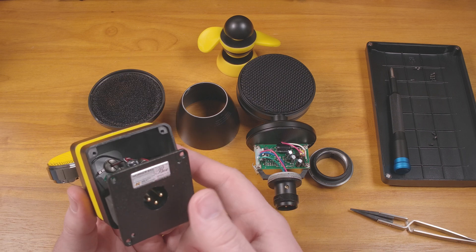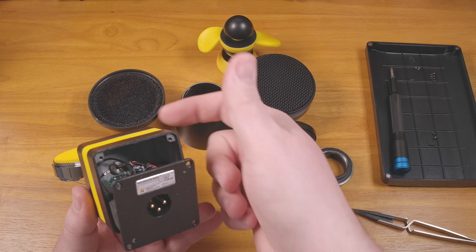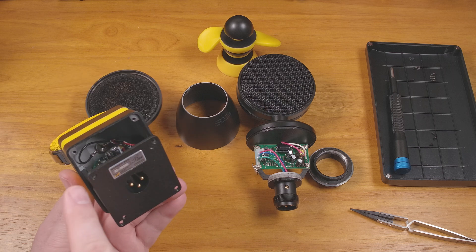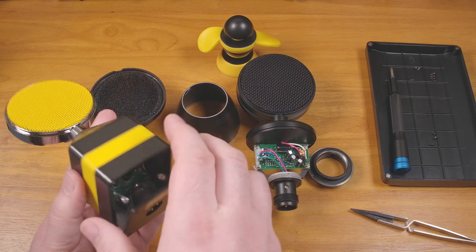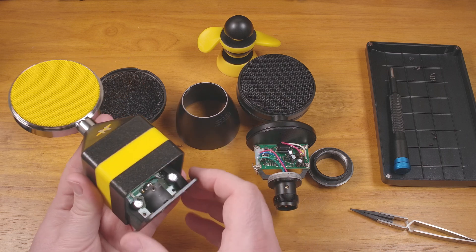As for the ground on the original, you can see the ground wire actually comes up and goes to a ring terminal, which is clamped underneath the screw that holds the whole upper capsule assembly to the body of the mic. So that ground wire just goes up and is clamped right in there, and the whole body is all one piece, so it's all one ground.